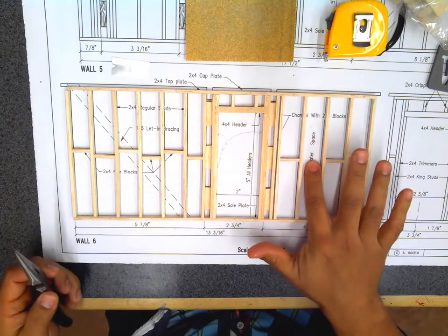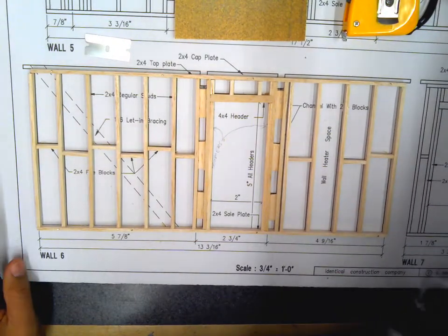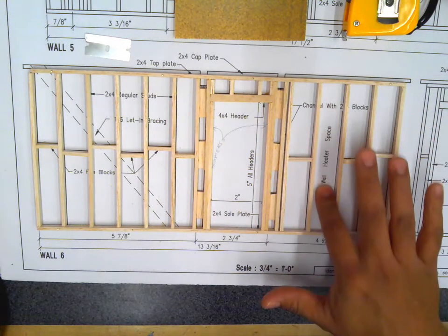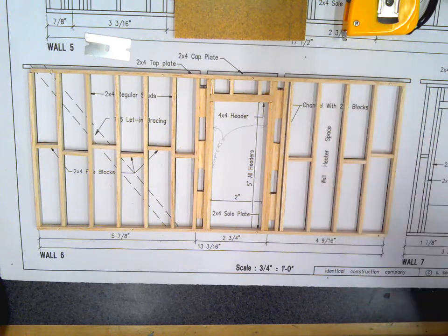Okay, again, right here, let me zoom in a little bit just to make sure you get more detail. Right here is a wall heater, and wall heaters are useful, and they're very inexpensive relative to a whole house system. So in this case, this might be $1,000, $1,500 to put a wall heating unit in here, and that's why we don't have this block nailed in. But for a small house, you can get a whole house heater, in my opinion, installed for less than $3,000.